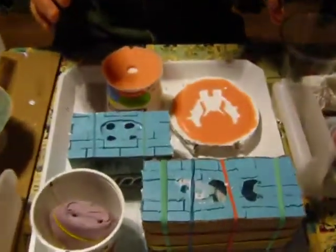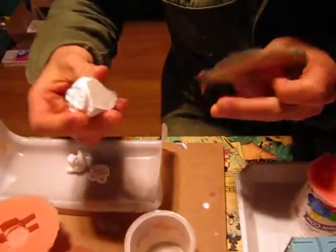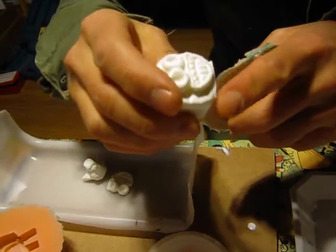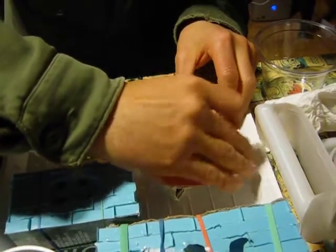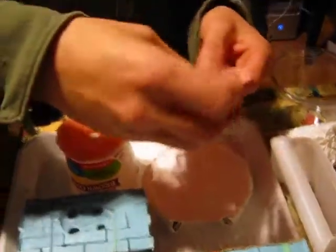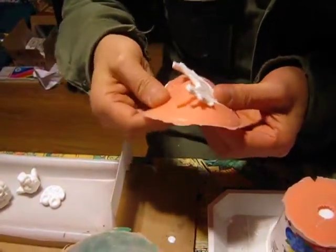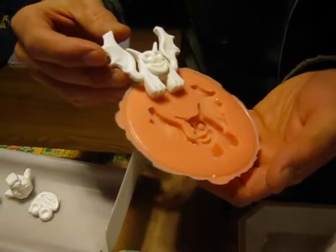I'm going to take a couple of these out — some still need more resin poured in to be filled to the top. So I'm going to take this swamp bogger out. This can be cut away with an X-Acto knife or sanded on 100 grit sandpaper and it'll smooth up real nice. This is just 10 minutes after pouring. Smooth-Cast 300 sets up really fast. Now it's ready to be cast again.